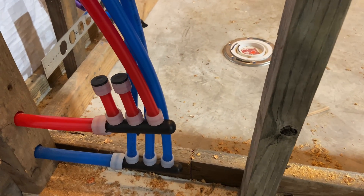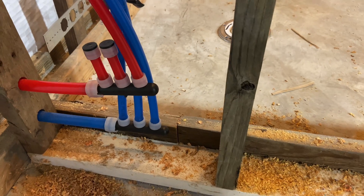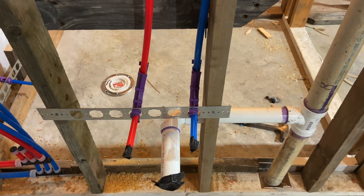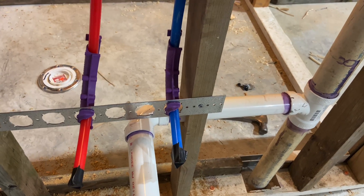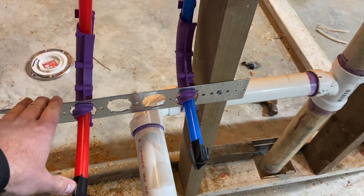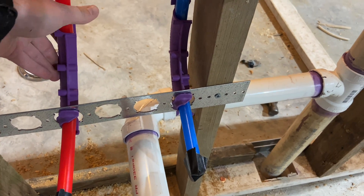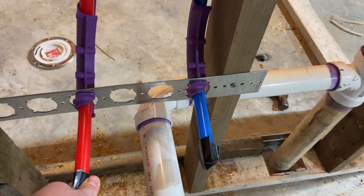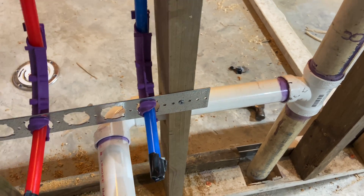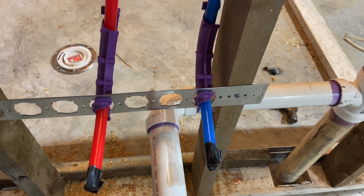Here I've got just a hot and cold manifold. For hot, I've got a single line going to the sink; the other two I've capped for now, so I've got expansion room if I need hot water elsewhere. Then I've got three colds: one for the sink, one for the toilet, and one for the outdoor spigot. I chose to go with all-PEX stub-outs rather than copper, brass, or galvanized nipples — cheaper, simpler, one less joint. With this Holdright bracket the way it holds in there, it's solid enough. I've got PEX-compatible shutoff valves, so that'll mount right there.